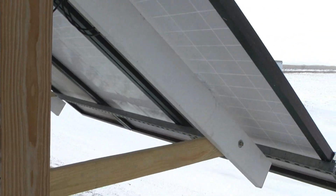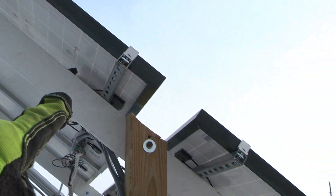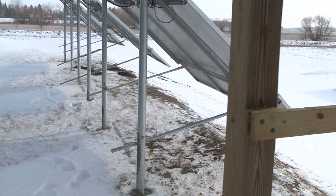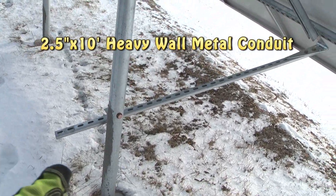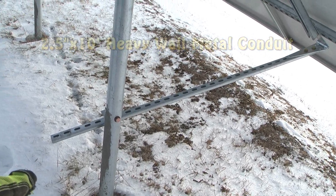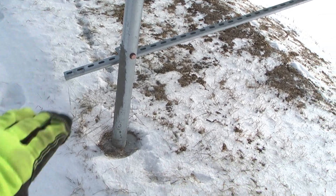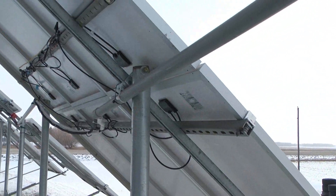Again, six by six, same way. These are two-by-six by ten. I really like them — I painted them before I put them up. My other three sets of panels are the same way — two-and-a-half inch, because two-and-a-half inch was cheaper than three-inch and I figured I can get by with two-and-a-half inch minimum. Again, three feet in the ground, concrete, all constructed the same way.